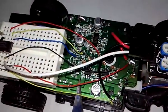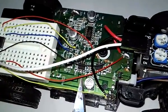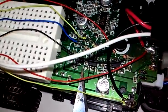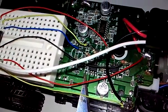If you look closely at the PCB down there, this X-Acto knife is pointing to a trace that I cut. I used an X-Acto knife just like this, basically scratching through that trace there above C30. That disconnects the radio and saves current.